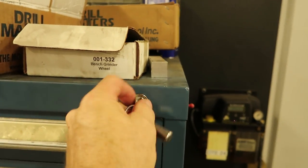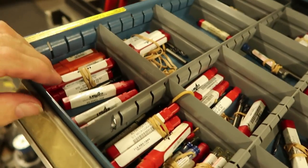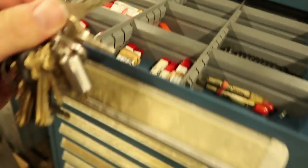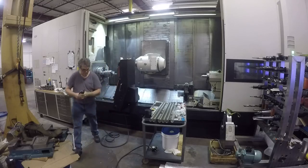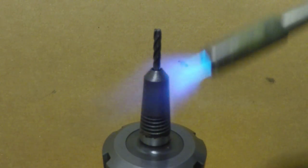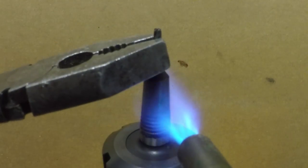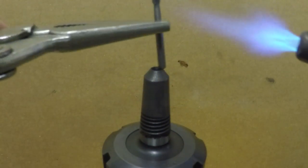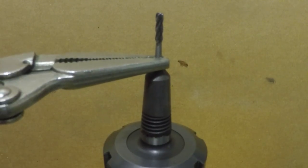Then roughing the little notches for the hinge portion of the back lid. I had to set up a new tool — an eighth-inch end mill. I grabbed a standard four-flute carbide end mill and ground a little bit of clearance on the shank with the drill grinder. Here I had to change the tool; this is a shrink holder — my poor man's version. I just heat them with a propane torch; I've been doing this for years and it works fine. I've changed the tool probably hundreds of times in this holder, and if you're careful you won't damage it. Just don't get it too hot — you don't want it red hot. Put the new tool in; you can see the clearance I ground on the shank.